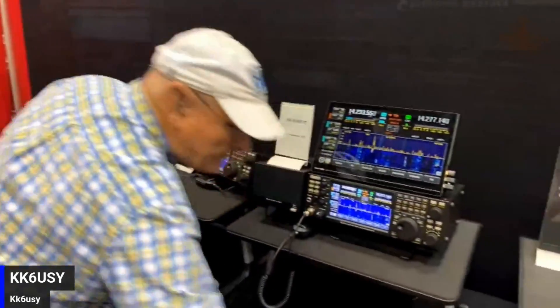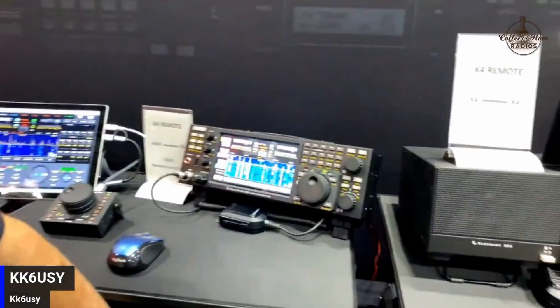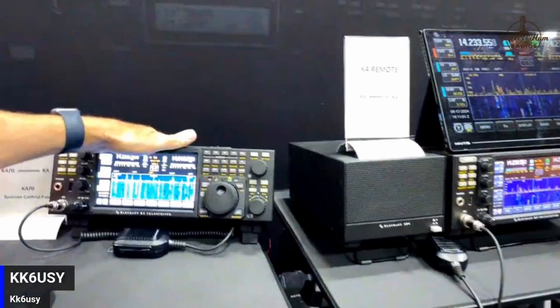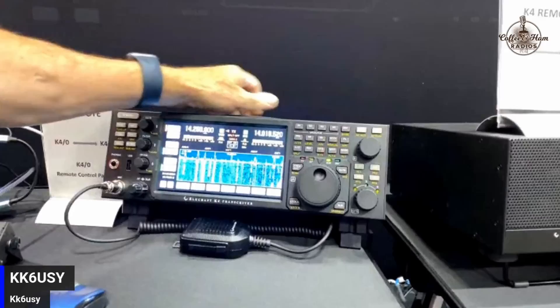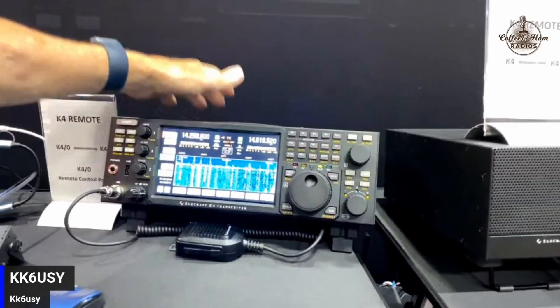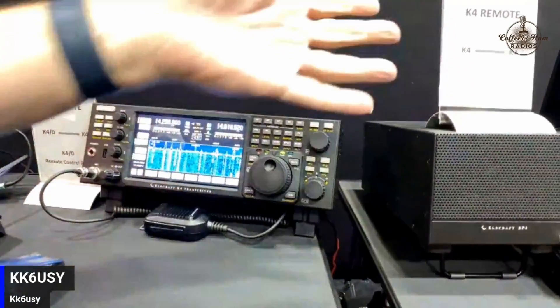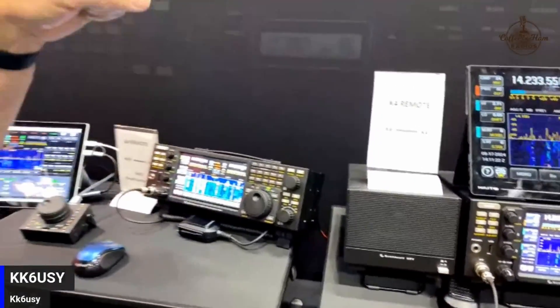We're also just coming out with a K4 Zero. This is a nice portable - it's not a radio itself, it's actually doing the same thing the K4 can do without the radio. It's like a remote control panel. You can take it on the road in a small padded bag. It's quite small - it has IO in the back for ethernet, you can put a wifi dongle into it, USB devices, the whole interface - same as on the K4, basically built-in sound card. You can put your laptop into it for logging, and it thinks it's talking locally but it's actually talking to the remote K4 halfway across the country. Any K4 standard can control another one.